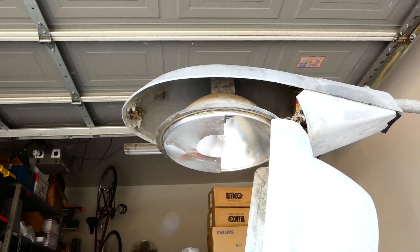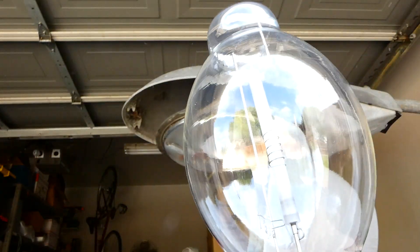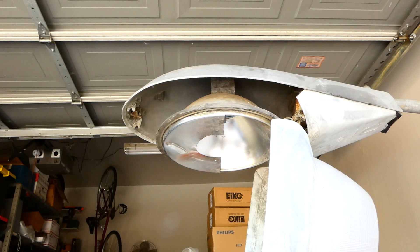What you're looking at here is a 1980 GE C400 Crime Fighter fixture, and what we're going to do — since it's been converted to mercury vapor — is bring it back to its sodium heritage with a Sylvania Unilux retrofit 360-watt lamp. This is made for a mercury ballast to convert to a slightly less power draw high-pressure sodium lamp. It doesn't need an igniter or anything, which is pretty cool.